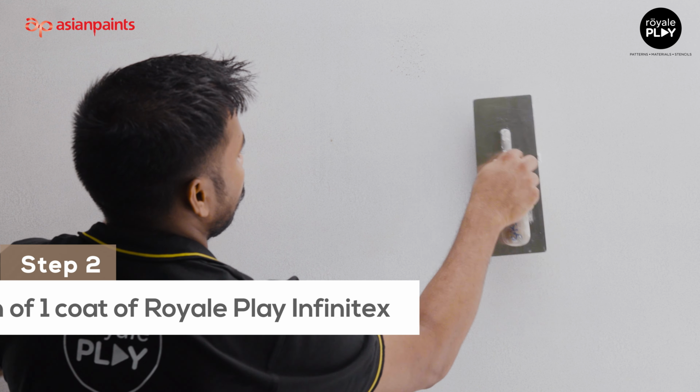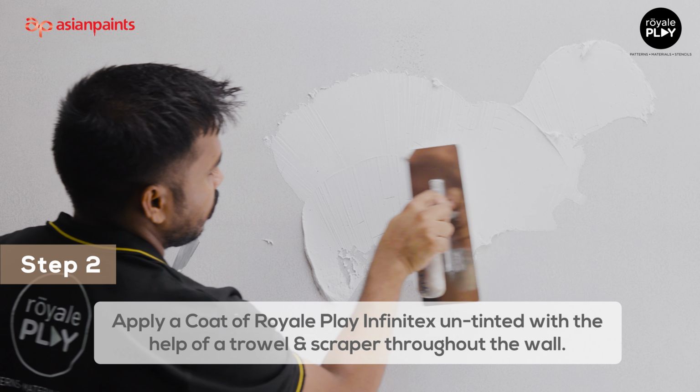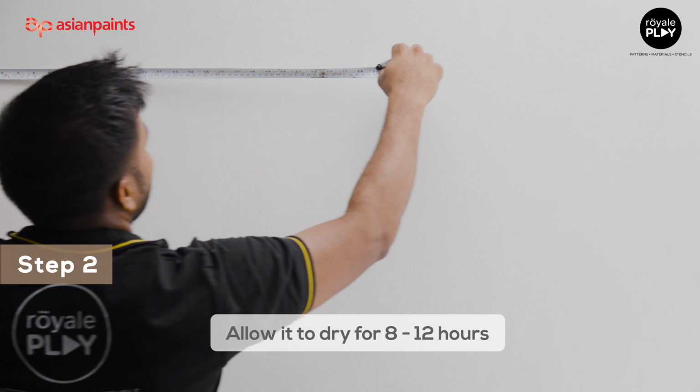The next step is application of Royale Play Infinitex. Apply a coat of Royale Play Infinitex untinted with the help of a trowel and scraper throughout the wall. Allow it to dry for 8 to 12 hours.